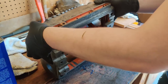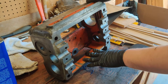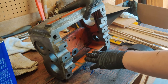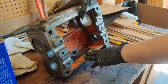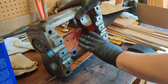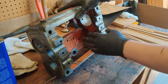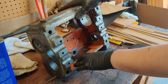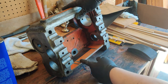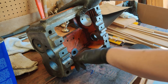One thing I am planning to do as well is — I've actually ordered the proper color of high-temp engine oil-resistant paint to go on the inside here, so that we can actually refinish the inside of these gearboxes. I want a nice clean flat coat that goes into all these so I can make sure I'm not leaving any chips or anything in there when I go to put everything back together. And second of all, as you can see here, I've got some of that paint remover that dripped down and kind of ate into that a little bit.